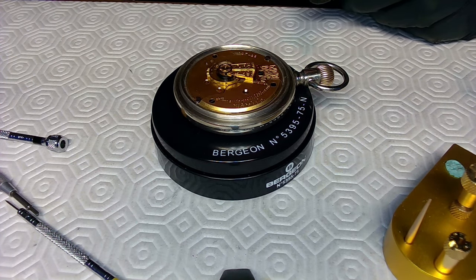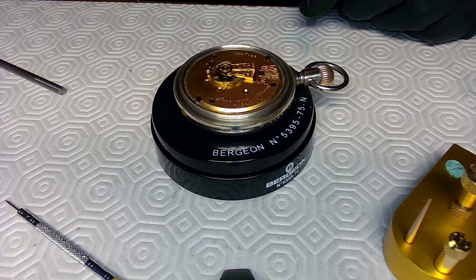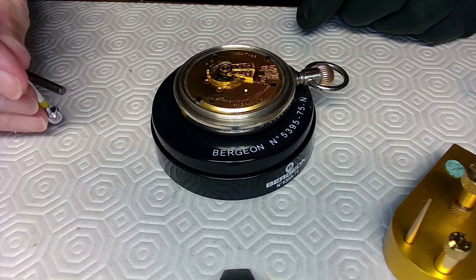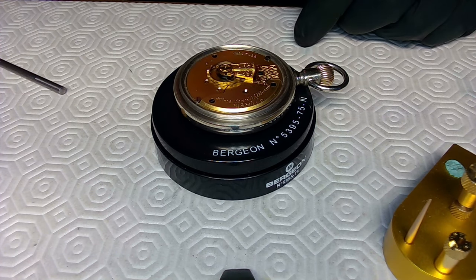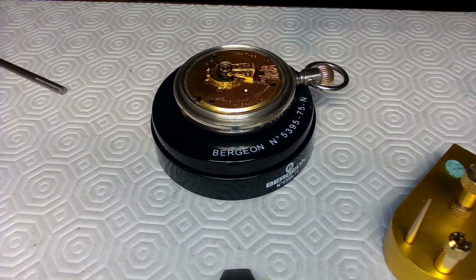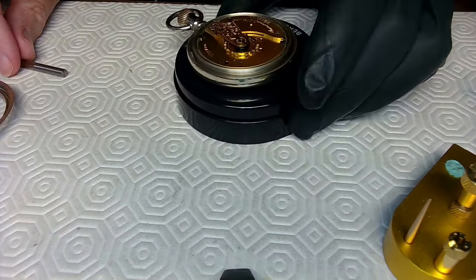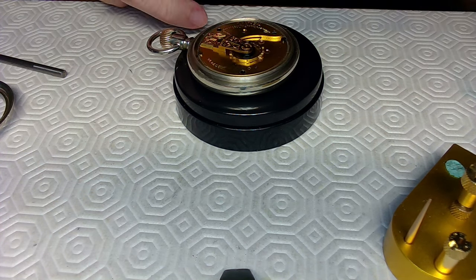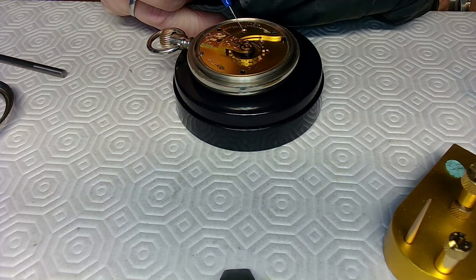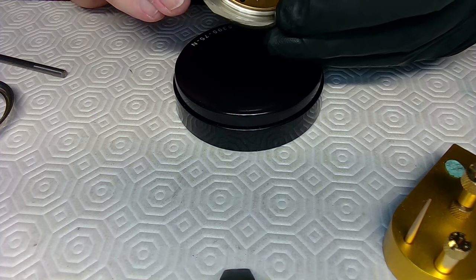That was a free service essentially. The cannon pinion is loose now — loosened but not so loose that it won't grab and turn the hour and minute wheel. I do have to test that to make sure it works, because the last thing I want is for the cannon pinion to cause a bigger problem. I also want to put a little oil on top here to have the least amount of friction going around. That oil will go straight down into the watch and not travel.